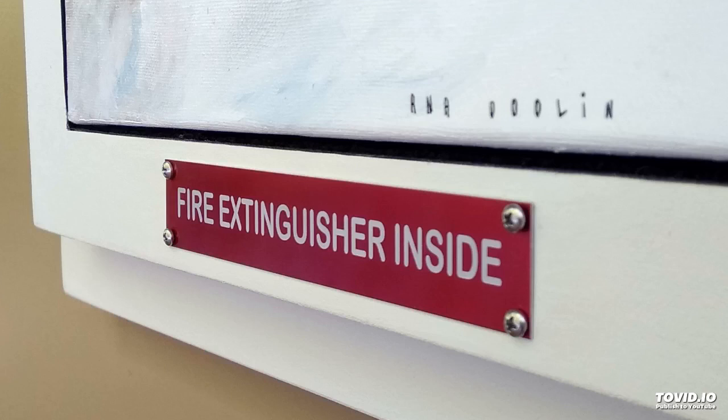Okay, once we get that panel off, if there's any insulation inside of the wall, you will have to get it out of the way. You can either cut it with a utility knife or any kind of sharp knife and remove it. That's the easiest thing. Or you can just stuff it either up or down into the wall. You have to tear it with your hands, or it'd be a nice thing to wear gloves for this. But the main thing you're doing here is getting it out of the way. And in this case, I'm removing it.